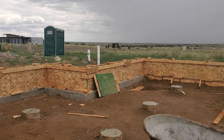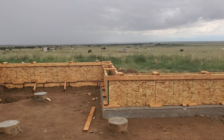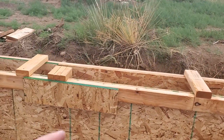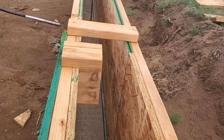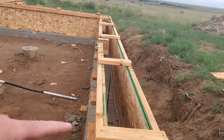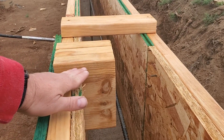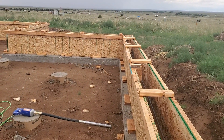We're here on concrete day. There's a big rainstorm out there — I hope that's not coming this way. The forms are done here. I've got the generator and vibrator. We went ahead and put these blocks in on the corner here — that's what the girders will go across. Once the concrete's poured we'll take these out and it'll be a nice little hole to set the girders in. We set them an inch and a half higher because we'll have the sill plate sitting here, so it'll be level and the joists will go all the way across nice and level.